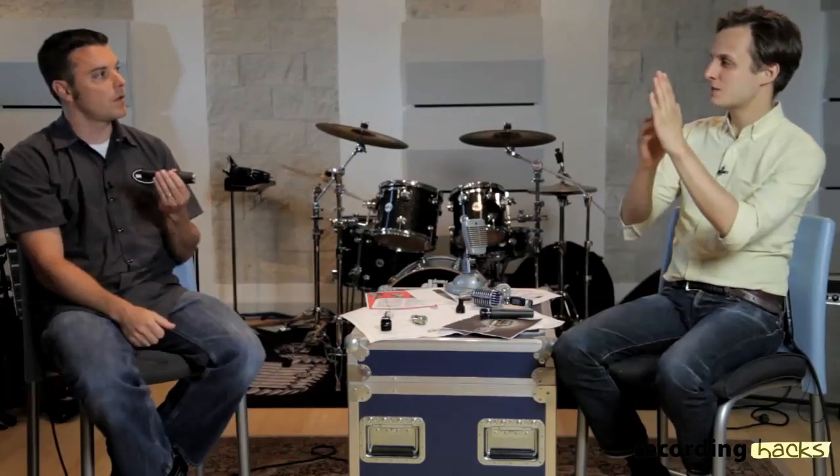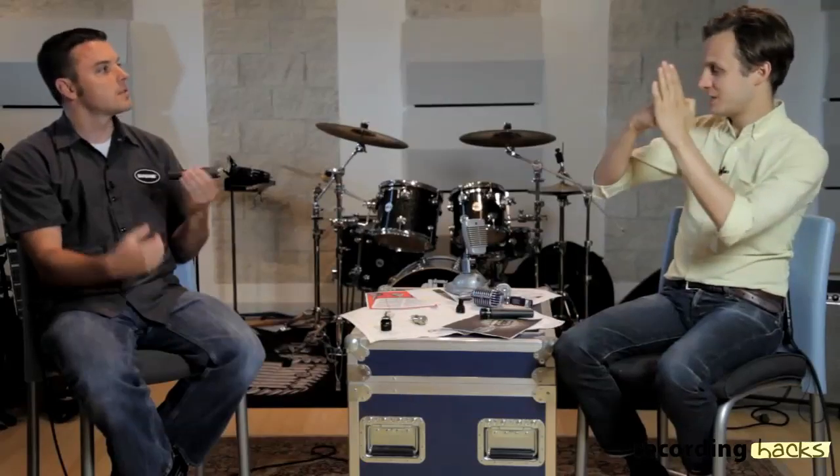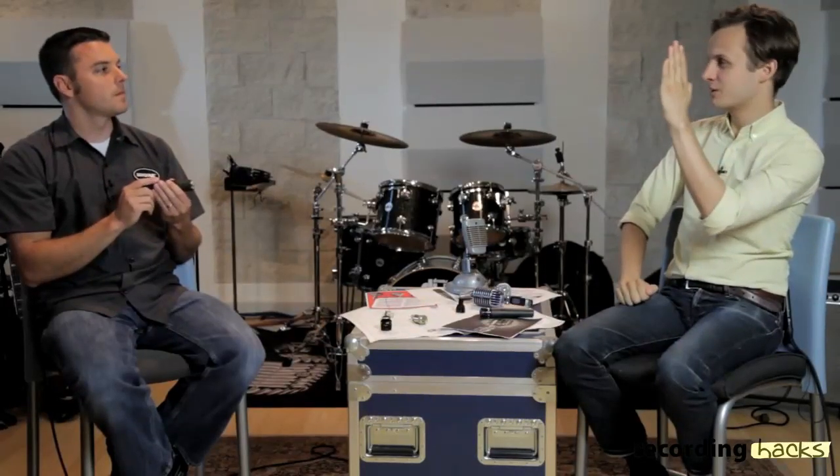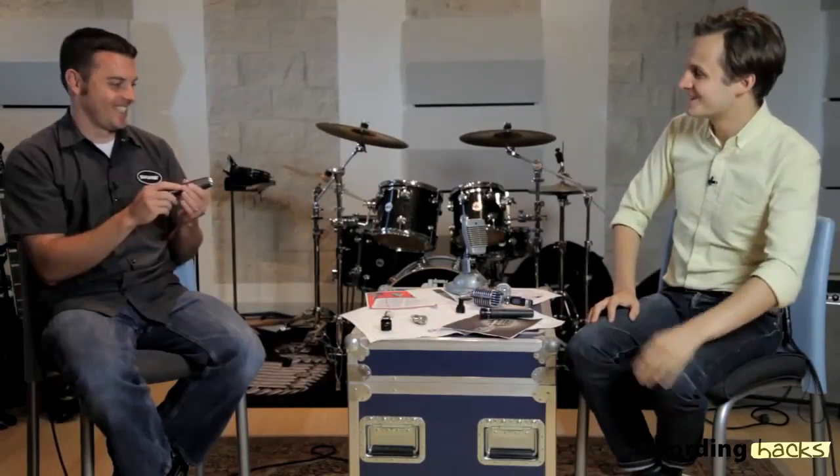It'd be like as if I had two people pushing with equal force on my hand. It's not going in either direction. It's not going to move anywhere, which means it's not going to move that coil, which means there's not going to be any voltage applied to that signal, because it's in the magnetic field. Wow. It's so clever. So simple, but so clever to be able to do that without any power. Without even getting to the electronic part first, we've already made it directional. Yes, it was really fascinating.